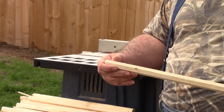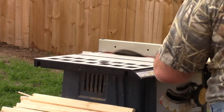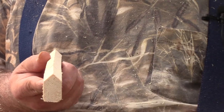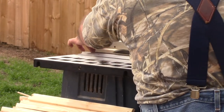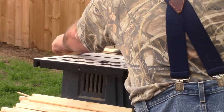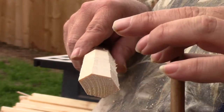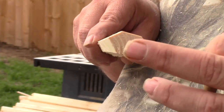Now once that 45-degree cut is made into the wood, which we ran it through this way, we're going to turn it over and run it this way to get 45 degrees on either side. So it now comes to a peak here. We're going to do the same on the other side so that our wood looks like that on the end — we have two 45-degree angles. Once I've cut all the boards, I'm going to come back and straighten the blade up and set it to cut down the center of this board to get two cleats out of this one angled top bar.